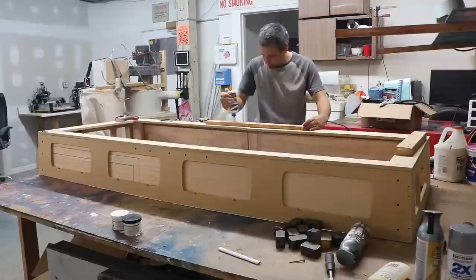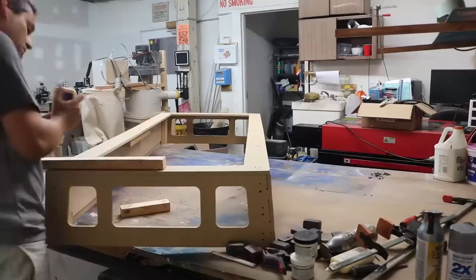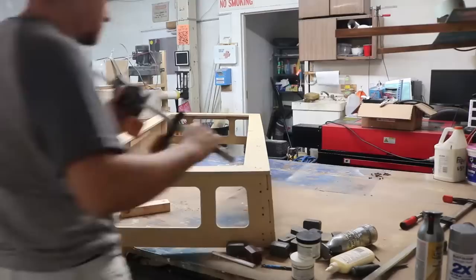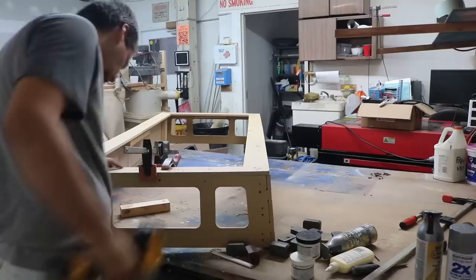I think for the top and the bottom and some of the edges — definitely the top and the bottom — you need narrower than a 2x4. So I ripped it to make it thinner or found some small scrap pieces of wood. These are glued in place, and I'm clamping so I can get the side of the box flush with the front of the box. When I screw it, it'll hold it in place, but the clamp helps me align it.